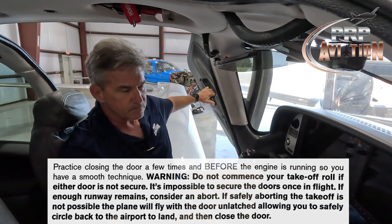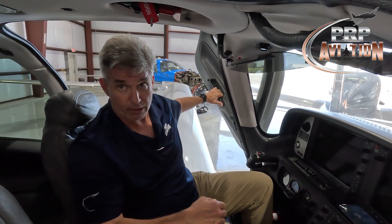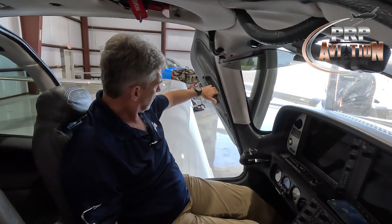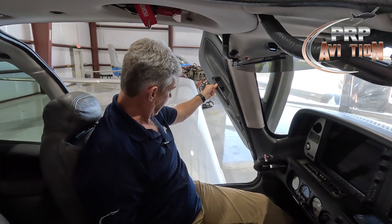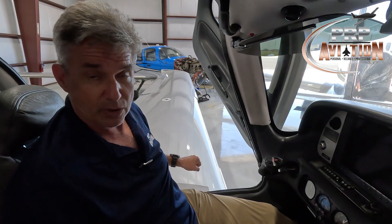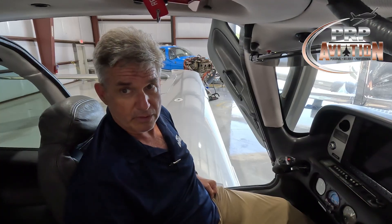Because of those latches popping, people started slamming the doors very hard since they were temperamental to latch properly. When closing the Gen 3 and Gen 5 door, avoid pulling your hand straight toward you. You want to follow the curve of the handle as it's attached to the door — curving through space — so as the door reaches the bottom part of the closing motion, a smooth, positive, continuous movement provides enough momentum to latch both latches.